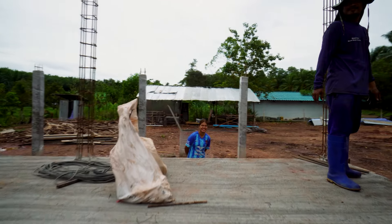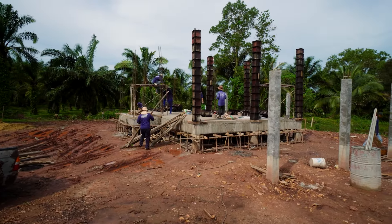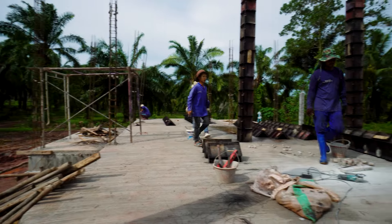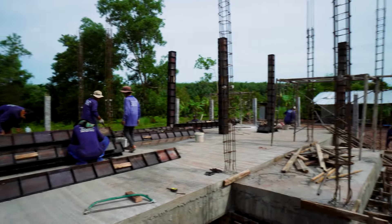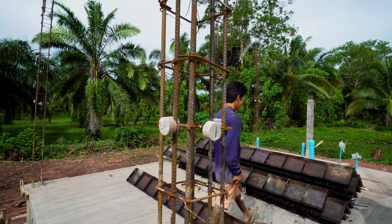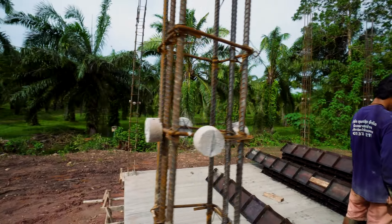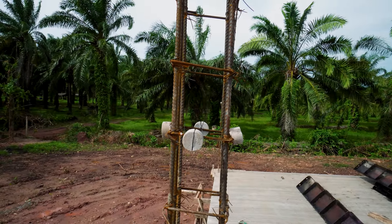There's our truck driver right there. Getting everything ready to pour the columns — this is going to be the last structural pour. I'm going to show you guys what to look for when they're setting up for pouring columns here. Now you can see the standoffs or rebar chairs, whatever you want to call them. In Thai they call it lukebund — if you translate that literally it would be the baby of cement.